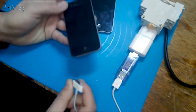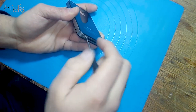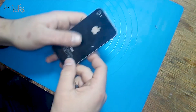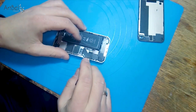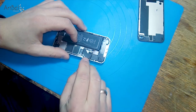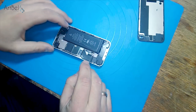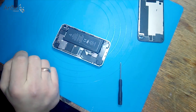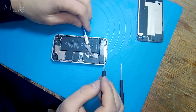Disconnect and set aside our charger and start to disassemble. Unscrew the two screws in the lower part. To remove the back cover, push it up and it's easily removed. Further you need to remove the connector of our battery — it's held with two screws, but not in our case. In our case there was only one screw left. This phone was already disassembled and the face on the screw was cut off.